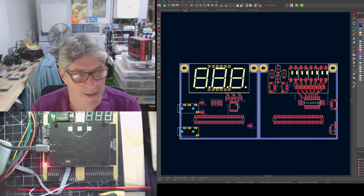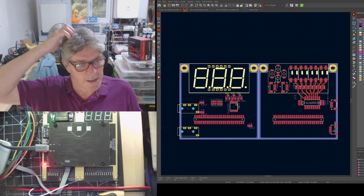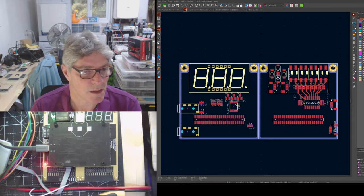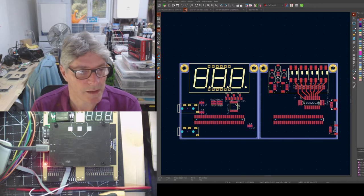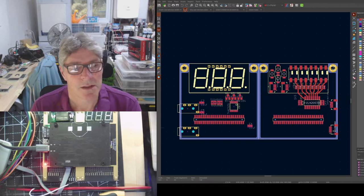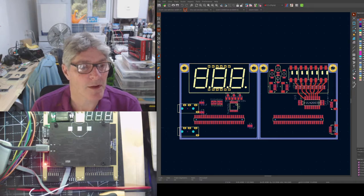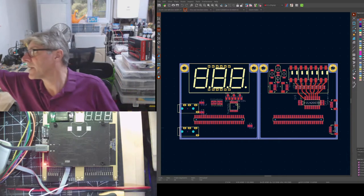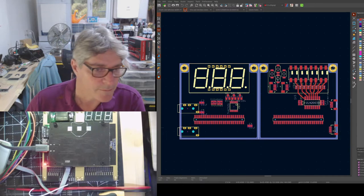And one of the things that I was thinking about on that front is if you're writing your PIO assembly, if you like, or commands in Python, aka the way that you would do it in MicroPython using the Raspberry Pi ASM for the PIO state machines, then there'd be enough information in the Python defined version of your PIO program such that it could be analyzed in Python and the state machine resources could be predetermined and synthesized and only what was needed. If it was all done in Python, was what I was thinking. Not only that, but you might be able to optimize some of it later on.